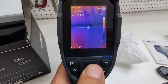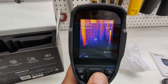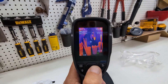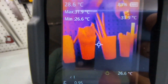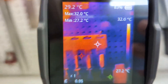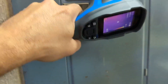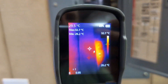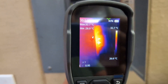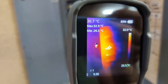You can see the green dot and the red dot as I move into an area — those are picking the hot and cold points on those surfaces. This is just showing me how heat, or the infrared, is bouncing off those surfaces. You can actually see that is a super clear image. Now let's try something a little bit hotter — let's get into this electrical panel and see what we got. There's some heat happening over there, which lets me know I probably should be looking at that side of the panel. Something's going on over there compared to the rest of the panel.